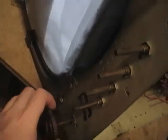While I wait for those inductors to arrive, there's another issue I want to tackle, and that's the washed out look on this picture. At first I thought maybe it's just the picture tube. This is possibly the original picture tube, and it's not aluminized like the last set I worked on, so it's not going to be quite as bright or crisp. But it turns out that actually it can get fairly bright. It's just the contrast is horrible. You really have to have the contrast up all the way and keep the brightness down fairly low to have a watchable picture.